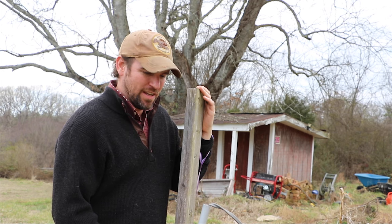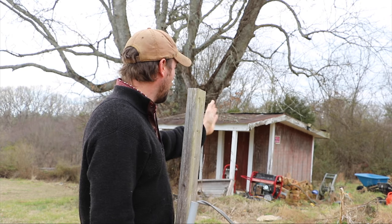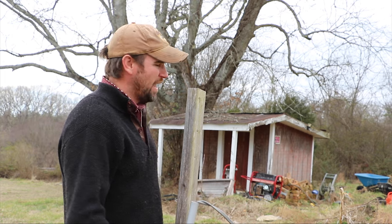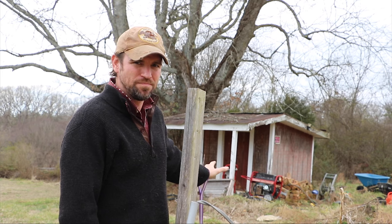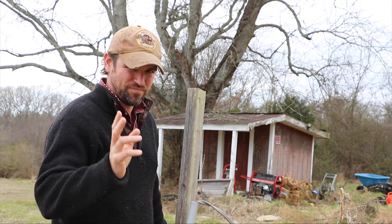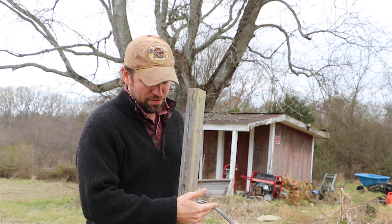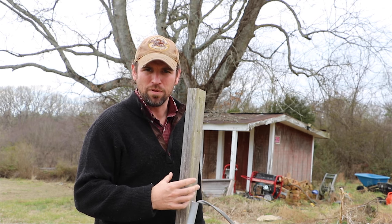What I have here is this piece of conduit coming out of the ground. When I dug the lines here to go to our well house and to our house — which are about 150 to 180 feet or so — we buried a power line from the house to the well with those water lines to power the well. That's a 240, so it's actually got two hots and a neutral for the well pump. We also buried a 30 amp circuit that came out here.